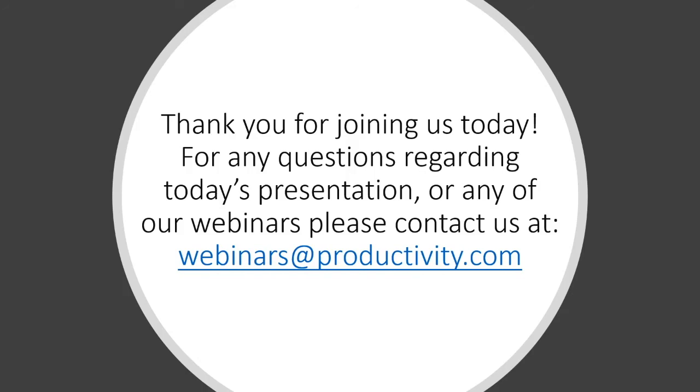Okay. Bob from Vincennes just made a comment, just a quick word of caution when writing probe programs manually. I had a student type M03 instead of M30 at the end of a program. Spindle turned on at the last commanded RPM, in this case 10,000 RPM. Yes, so that's why I talked about never spinning the probe. Just be diligent with it. Definitely check, maybe just do a search for M3.